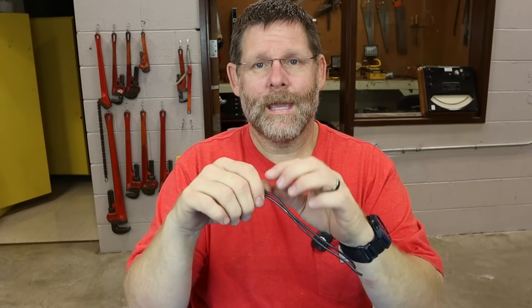I'm going to be stripping 12 gauge wire and making the perfect wire joint. I've done a video on this before because I've seen so many people not do it right. Not saying mine is the only way, but I'm saying mine is the easiest way, so you guys will always know exactly how long to make it and your wire nut will always cover. Another thing — you never use the wire nut to twist your wires. In my class, I will fail you and you will lose all your points every day until you do it the way I'm showing you.